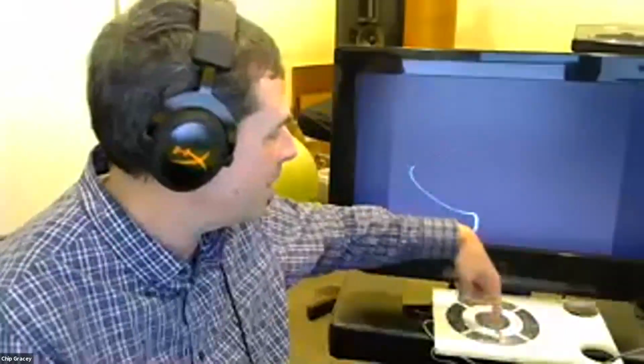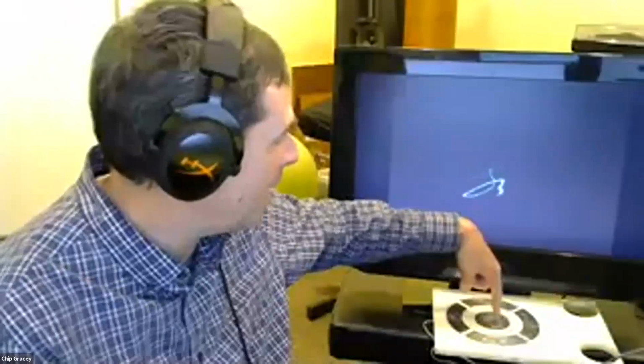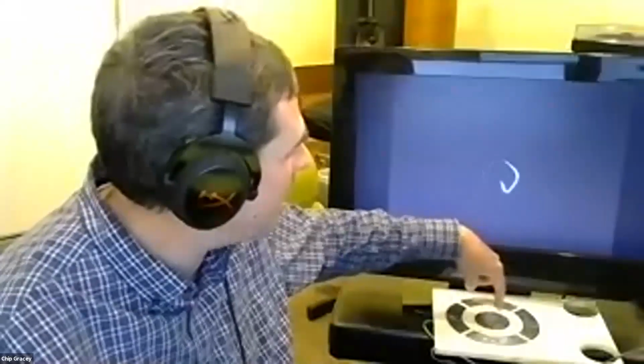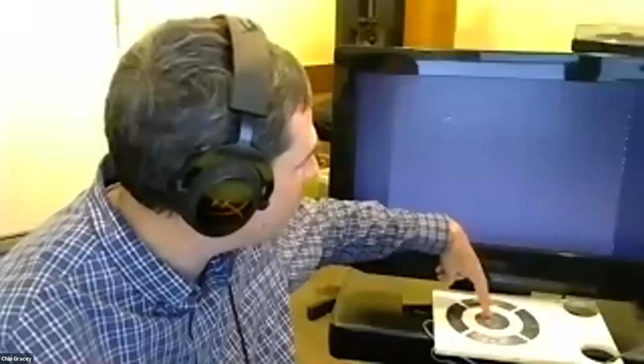Okay, so anyway, the Goertzel engine, it's actually a streamer function, right? It's part of the streamer. It can output on 4 DAC channels 4 separate waveforms. So what we have here is like 0 degrees, 90, 180, 270, and then there's a pickup right here. So as you move your finger on this, it's outputting 600 kilohertz sine waves, right? And it's checking for coupling. It's listening on this pin with the Goertzel thing, which is kind of like a slice of a Fourier transform. So it's just continuously measuring. So if I go this way, it's coupling between these two more. If I go over here, it couples between these two. So see, that's the vertical.